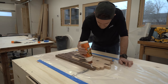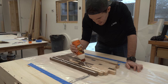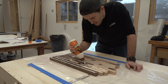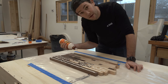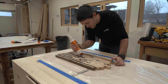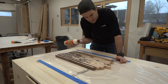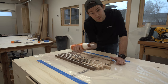The interesting thing about wood glue is that it's actually stronger than the internal bonds in the wood itself if you apply it correctly. You can glue two pieces of wood together, try and smash them, and the wood itself will break before the glue joint. As soon as I learned that, I was like, I'm off to the races — I'm going to build some crazy stuff just by gluing wood together. People also ask whether I glue the little end joints together, and the answer is no. I just try and stagger all the end joints so there's nice overlap between the pieces — I try not to have seams directly next to each other because that creates weak points.